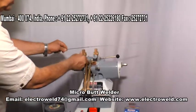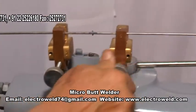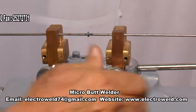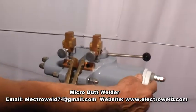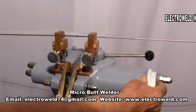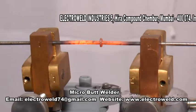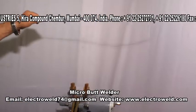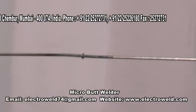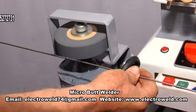Then clamp the wires to be annealed in these two annealing jaws so that the welded joint is in the midway, and then tighten the wire. Now again for annealing, depress the same button until you get the reddish tinge of the welded joint. Like this — then you can release the button. The joint is now welded properly and annealed.